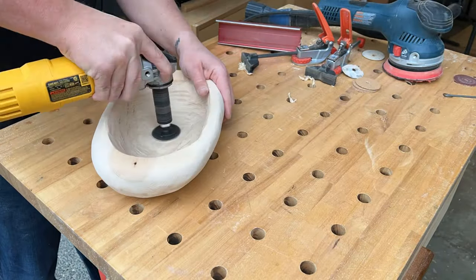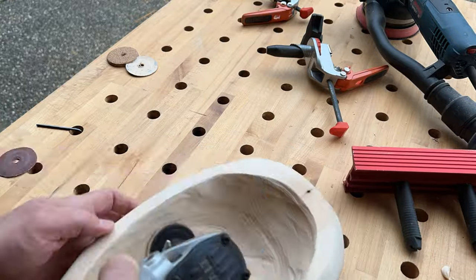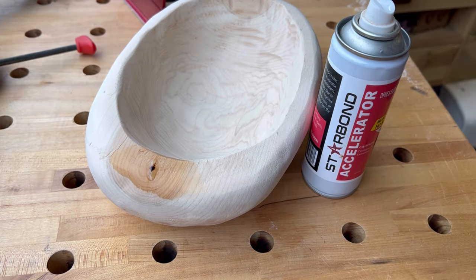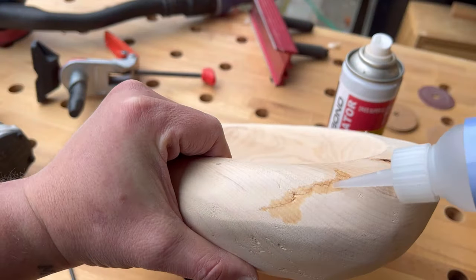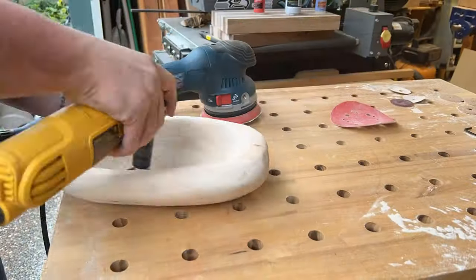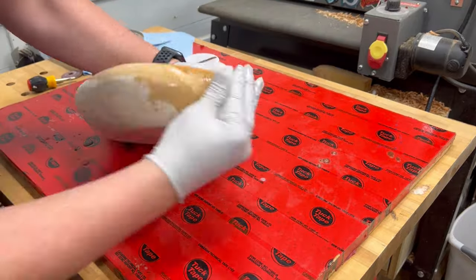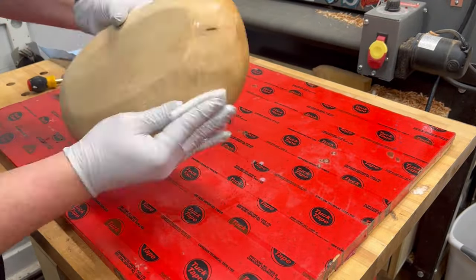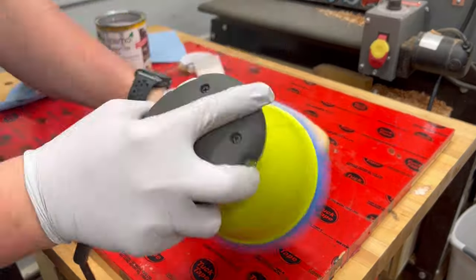I actually have another video on my channel that talks about specialty sanders. This one in particular does a great job of removing any tooling marks or if you kind of messed up a bit — it gets it nice and smooth. I did have a couple of cracks, so I'm using CA glue and activator — it's a super glue and it works really quickly. You could use epoxy if you had a bigger issue. I had that split, thought I got most of it with carving, but still had it. I went with a thinner CA glue to really get in there, and with the activator it cured right away. You really can't tell unless you know to look for it. Now I'm just adding some finish. Later in the video I'll go a lot slower and talk about all the different finish types. This is one finish type — this is Osmo Poly X. It's a hard wax and it's a great finish.